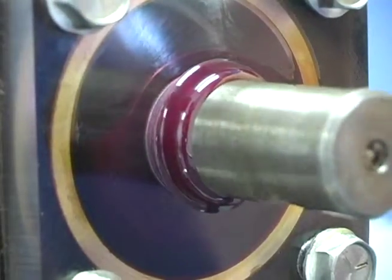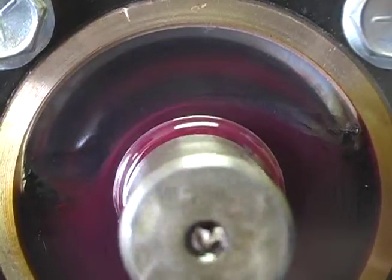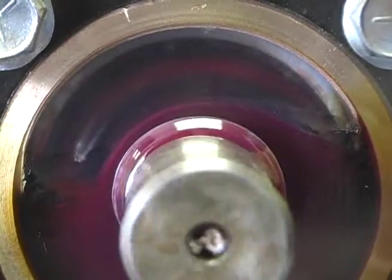In the field, dirt and water would mix with this over a period of time and seal this gearbox off so that it wouldn't leak. It not only kept the oil from leaking out, but it kept the water from coming in, kind of formed a seal. Because we had a lot of problems with seals on the older gear. Every gearbox would have water in it. And now we probably had 5 out of 240 that had water in them.